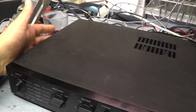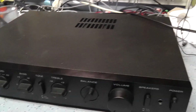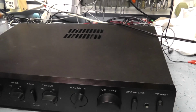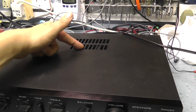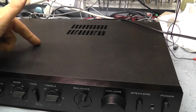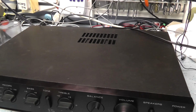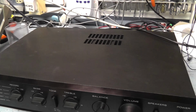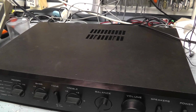We've got this TO220 linear regulator on the side of this chassis here. It generates a lot of heat. We've obviously got the heat sinks are fairly well ventilated, but we've got all the TR4 resistors here, or these MFR4s or whatever they are. These resistors run very hot. As you can see, I could hardly touch them, they were so hot. They're inadequately cooled in my opinion.